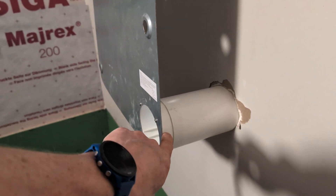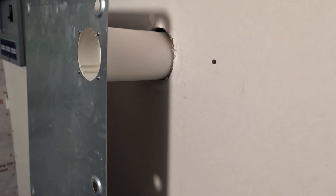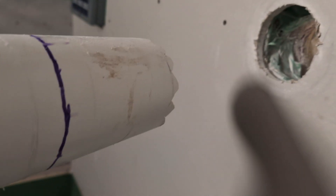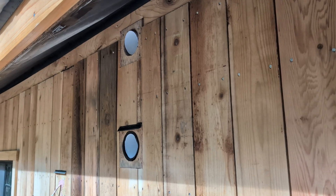Making progress on the ERV. I've drilled the hole through the wall up top and down below, then attached the adapter to the plate and shoved the whole assembly through. On the other side I marked them, so now if I take this off you can see that's the width of the wall — so we'll cut that off. I made some teeth on one of them so I could make the initial hole going in from the back, and then we'll fit it back through and put on the soft plush seals, plus a rubber seal.